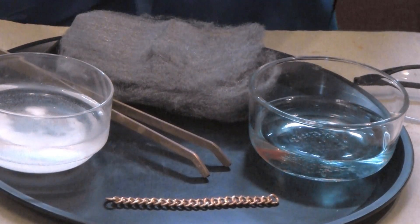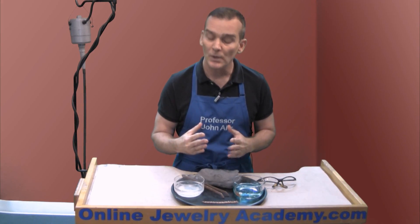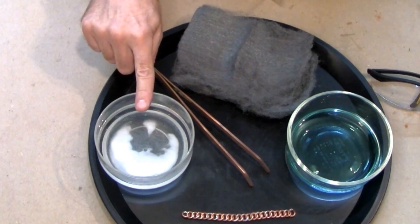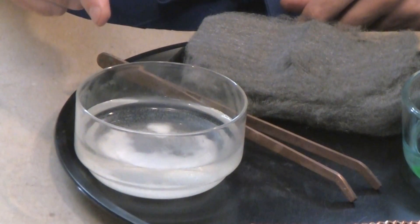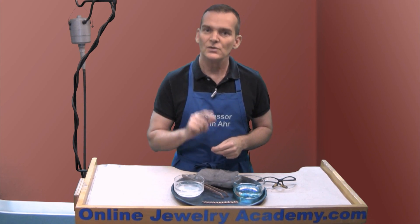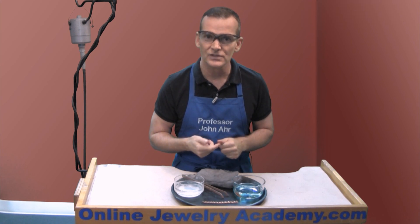This process uses a little bit of your spent pickle — used pickle that's saturated with copper sulfate. That's what turns it blue. We're also going to use fresh steel, in this case steel wool, a pair of copper tongs, and some neutralization fluid. This is tap water with a little bit of baking soda, and you need this because you don't want to handle a piece directly out of your pickle pot — you could get a chemical burn. You also want to practice good safety habits and put on some eye protection just in case you splash any of the pickle solution into your face.